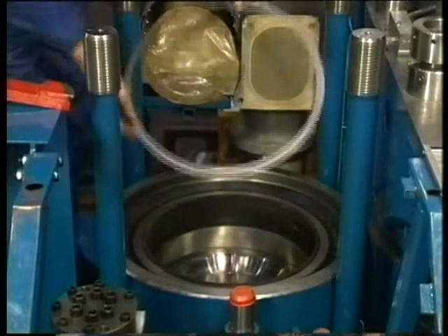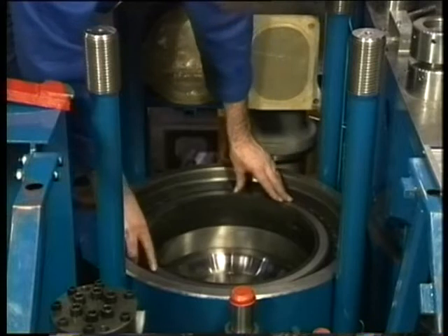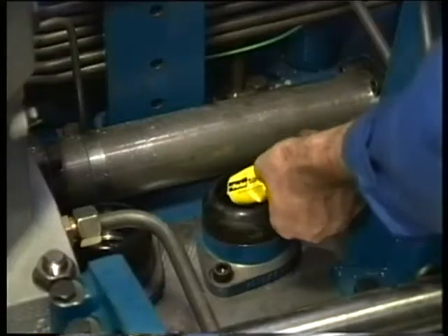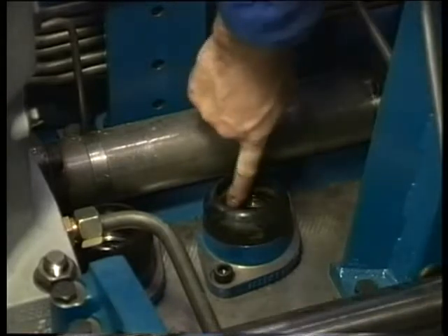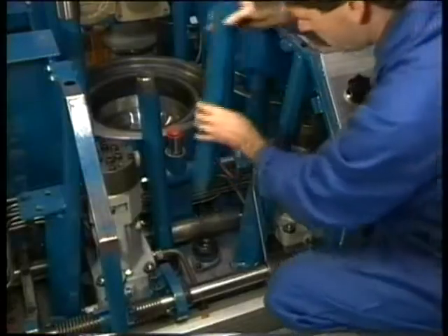When mounting a cylinder head always use a new steel gas sealing ring. The gas sealing faces of both the cylinder liner and the cylinder head must be in good condition. Otherwise lap them slightly with a lapping ring. Clean the push rod sealing rings thoroughly and grease them with the required silicone grease which keeps the rubber in good condition. Subsequently place the push rod protecting pipes.